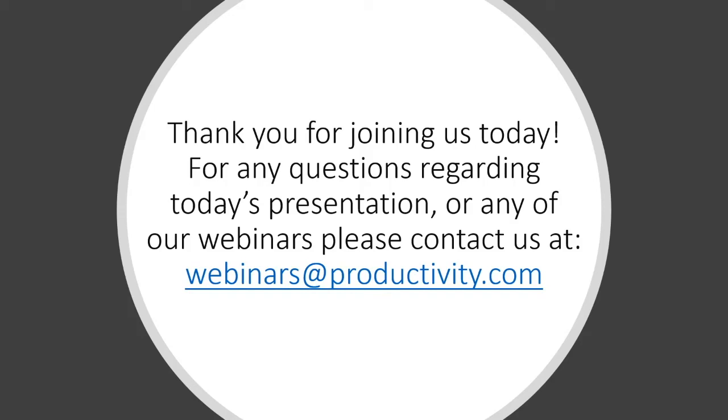Okay, thank you. Carl is asking, when using G65 for another portion of the program after turning the probe on, does this turn off protected positioning as well? No, you're not really turning on or off protected positioning. Think of protected positioning like G1. If you want to do another protected position, you just have to call it and move the probe. So you can't do protected positioning unless the probe is on, though.